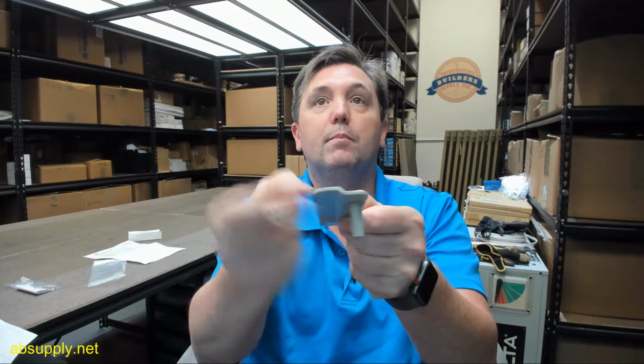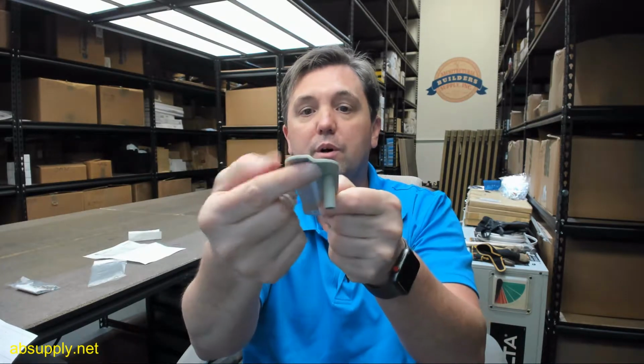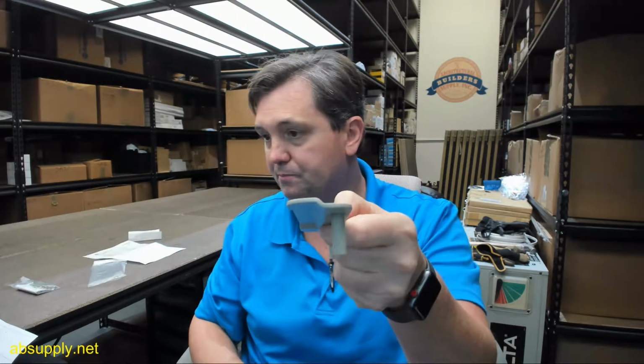You know, if you ran your hand over the face of the door and frame, the door is not flush. In aluminum storefront, they can be flush, but in hollow metal work, they're not generally. So those are pushed in to the frame about 3/32 of an inch, and that's what the offset here would account for. Okay, 3/8 of an inch over is what you're going to be on that template, and looking at that, it'll give the rest of the dimensional properties, and let's take a look at that right now.